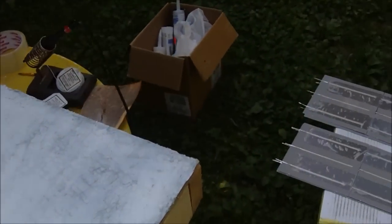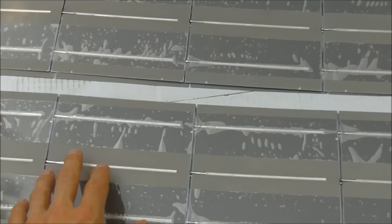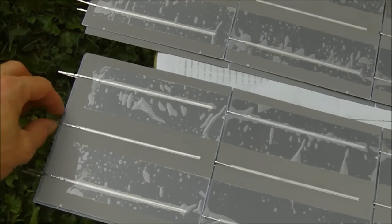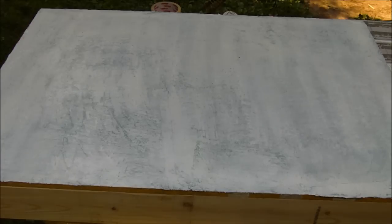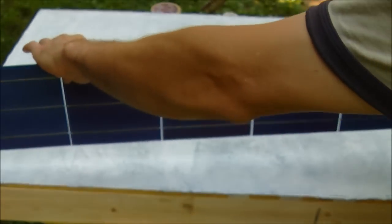The paint has dried now and I'm going to start laying out my solar cells. I have my solar cells here already soldered in rows and they've been taped and reinforced. My other videos show you how to solder these together and extend the bus bars — I'm not covering that in this video. I'm going to grab a row of cells very carefully, bring them over to the panel, and lay them down. I'm going to put the positive up at the top, so the positive wire on the back of the cell will be at the top of the panel.